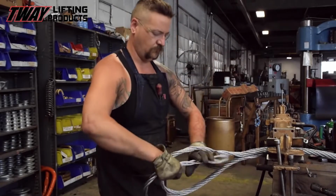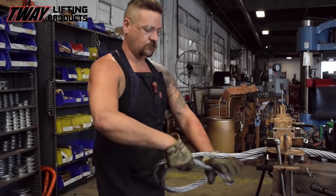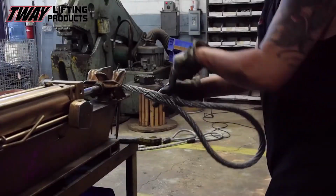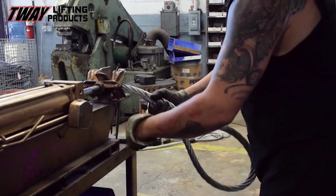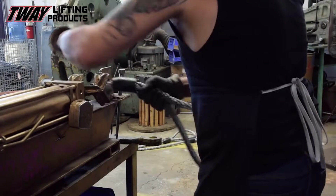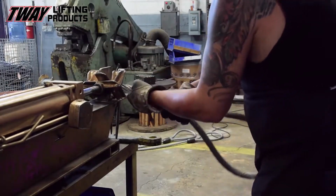After setting the eye, the strands are reassembled in the reverse of their original position. This technique provides a friction hold to the splice. After tidying up the tails, a compression sleeve is placed firmly over them and checked for correct engagement.